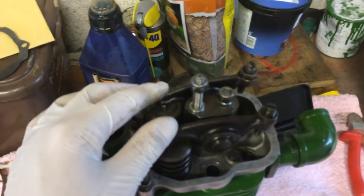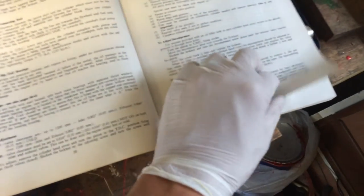It's got to be done — there's no other way around it if you want to get your bump clearances right. It's always advisable to have your user's manual. There's one for your Petter and one for your Lister — these manuals are invaluable, giving you all your torque settings and so on. Looking at the bump clearances: for the Lister SR1 engine you're talking about 35 to 38 thou, and the LR engine is slightly different. All the engines are different basically, so you need to check your manual carefully.